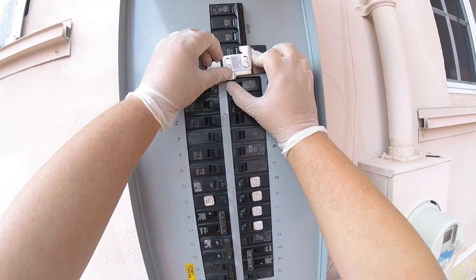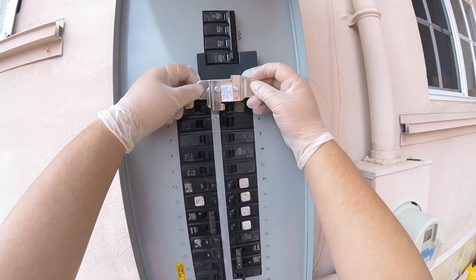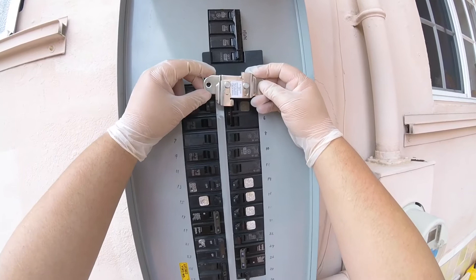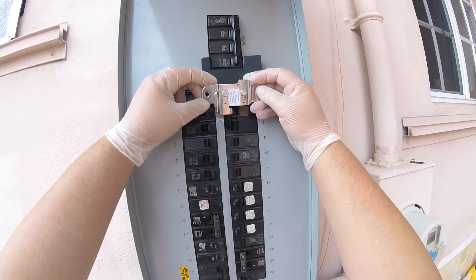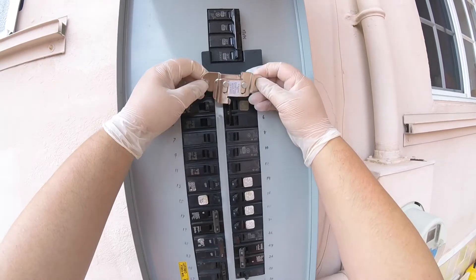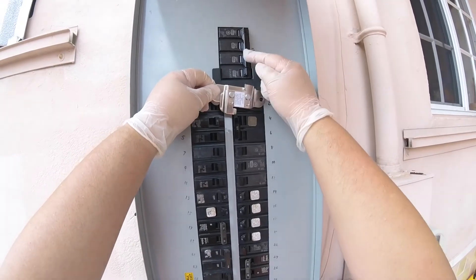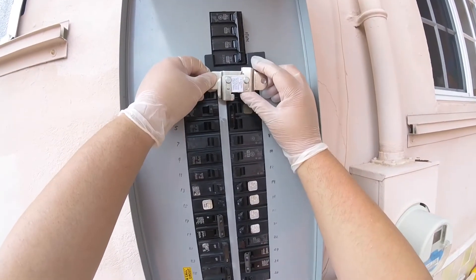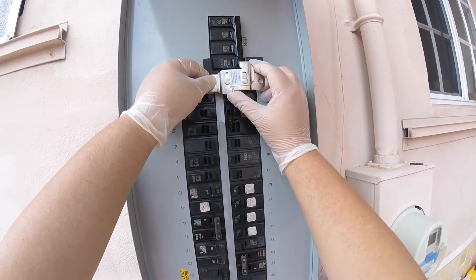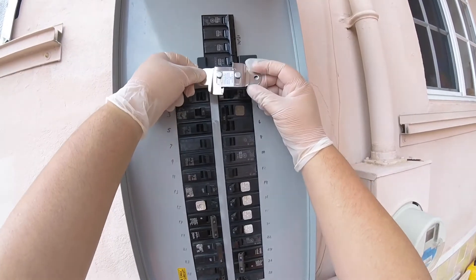This is very important — not just for yourself and your generator. Because if the mains feed back into the generator, damage is likely and explosion is possible. But if you feed power into the mains, you can injure the lineman who is trying to fix the power to your house. So it's a great thing to have — inexpensive, about $50.